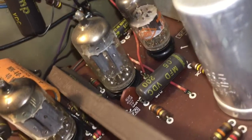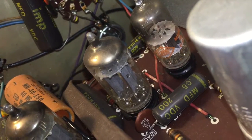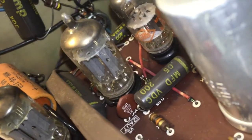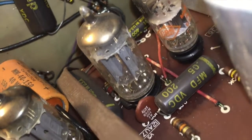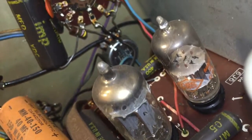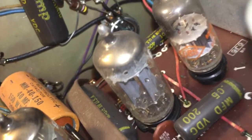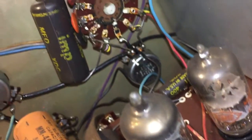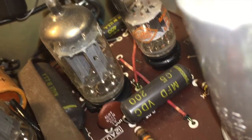Interesting note: within this entire unit, which has been thoroughly inspected, there's corrosion that only affects these two red wires — at the endpoints and where it's pulled back from the shielding. As you can see, it's green. The wires have a white substance on them. The wires are separate, not part of the same circuit — tied off at different endpoints. You can see the green there as well, and on the board. Nowhere else.